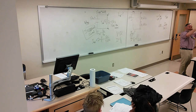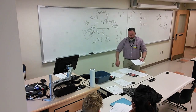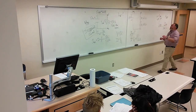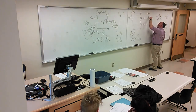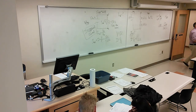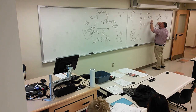So we know it's not that, because we can see that it's not that. We can see it's this. It's series, and it has a word for it. We go to series. And if we grab our equation sheet, which I have buried here somewhere, we know that there are equations for a series circuit. So this is the series circuit. That's the same. And the total resistance for the entire circuit is just add up all the individual resistors. The giant Greek letter sigma means sum them up. Okay? So we've already solved this problem before. We know it's the same problem as doing series.